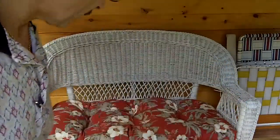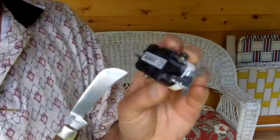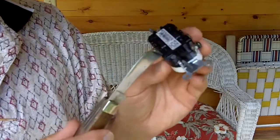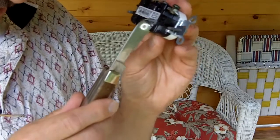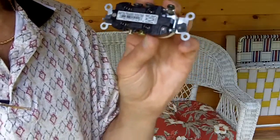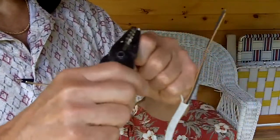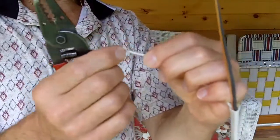On this receptacle, they usually show you a strip gauge. It'll help you gauge the proper amount of insulation to strip off the wire. It's right here, and it's approximately half-inch to five-eighths of an inch long. You can use this gauge to know the proper amount of insulation to strip off. Once you do this a few times, you just about know, and you strip it off like that — you can see that bare copper.